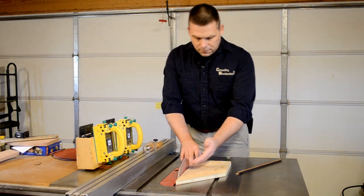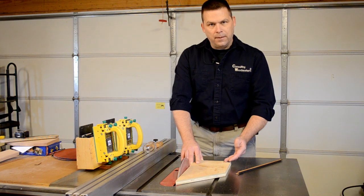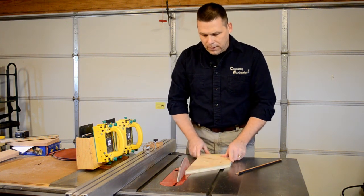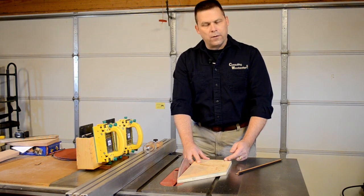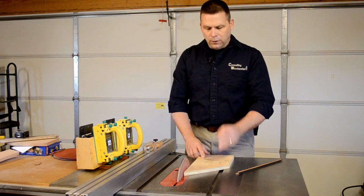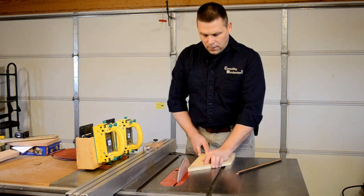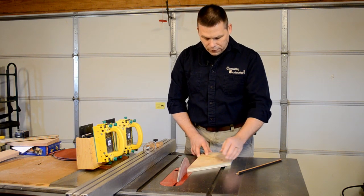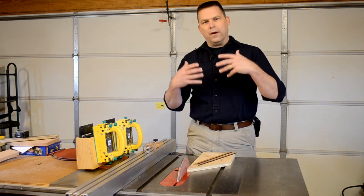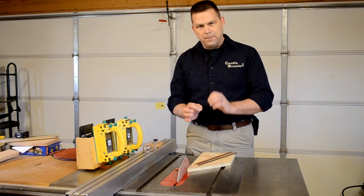I've got about five and a quarter inches from the disc to the centerline of my miter slot, so I allowed for about an eighth of an inch so I don't get any rubbing, and then it's just three holes drilled and counterbored through, four inches on center. This is a quick and easy way to get really super accurate, easy, and safe miters on small thin pieces.